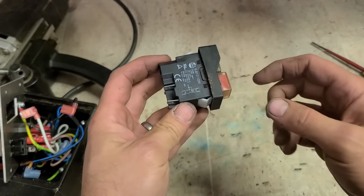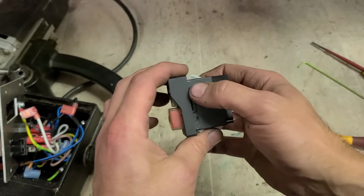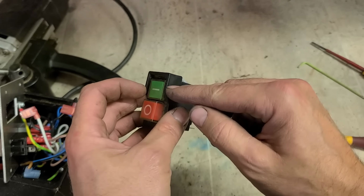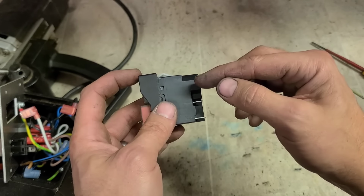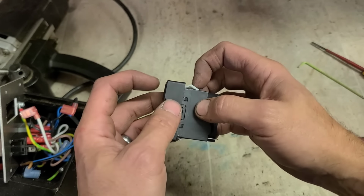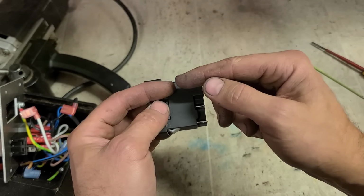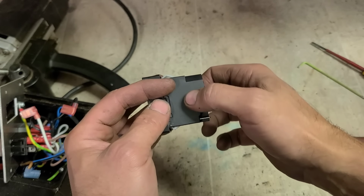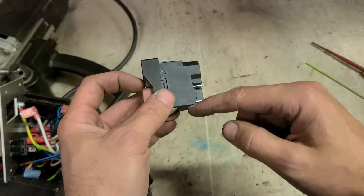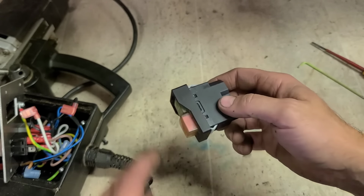Now, inside of here, it's just a normal on-off switch. But up here, there should be an electromagnet, and that basically has a metal pin from the on switch. Whenever you energize it, there's coils in the electromagnet. Energize, turn on the magnet, hold the pin on. What happens is one of the wee coils either breaks, or the connection for them breaks over here or wears out. So eventually the switch back here keeps working, but the electromagnet just doesn't keep it switched on.